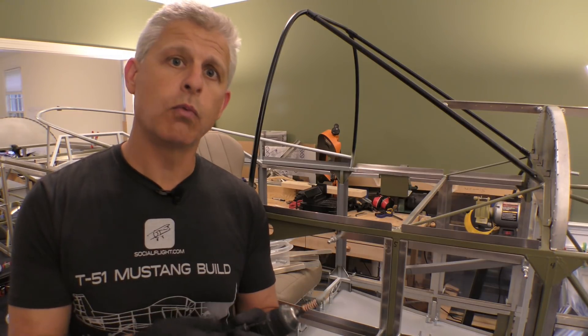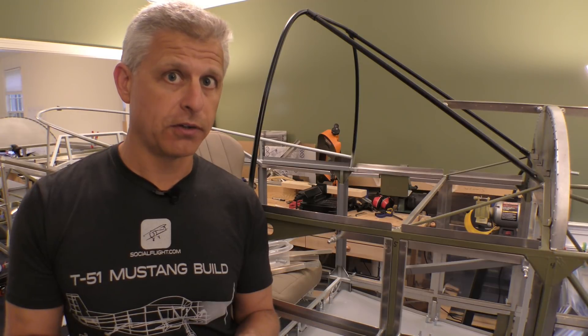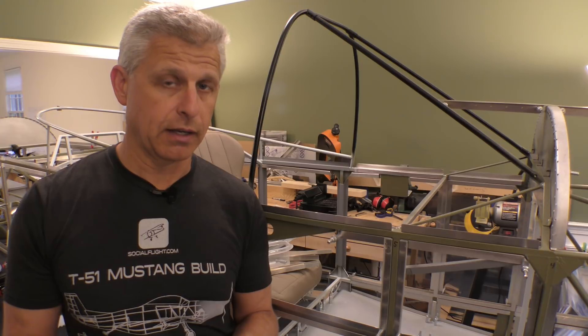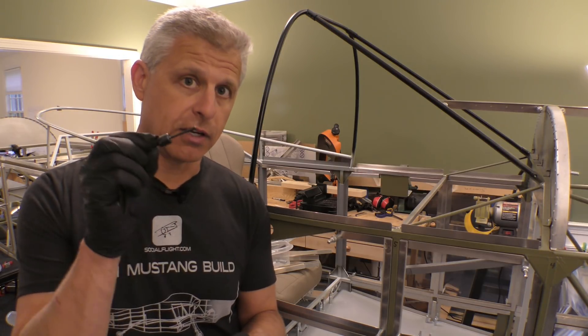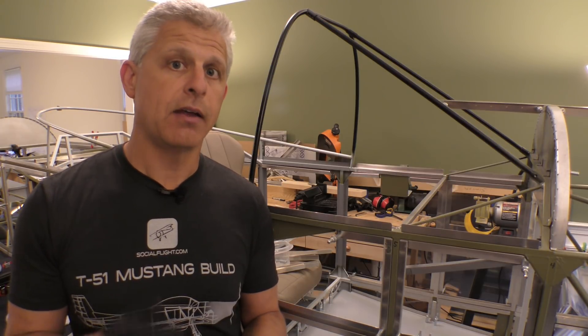This is a great tool. You wind up with a little excess material — burrs is what it's called — that happens when you drill sheet metal, and we need to clean that up before we put the rivets in. This deburr master has a spring-loaded cutting edge; it's going to go through and back super quick, get that all cleaned up and ready for the rivet.